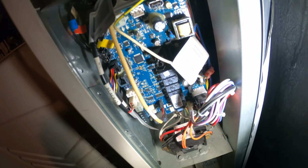Okay, so just to pull back this insulation, and right here is the sensor. Oh, and you can see right here it says T4. So let's unclip this. This is the T4 thermistor. Here's the T4 thermistor on this end, so we're kind of just gonna run these wires back and pull out the thermistor, but also check resistance.